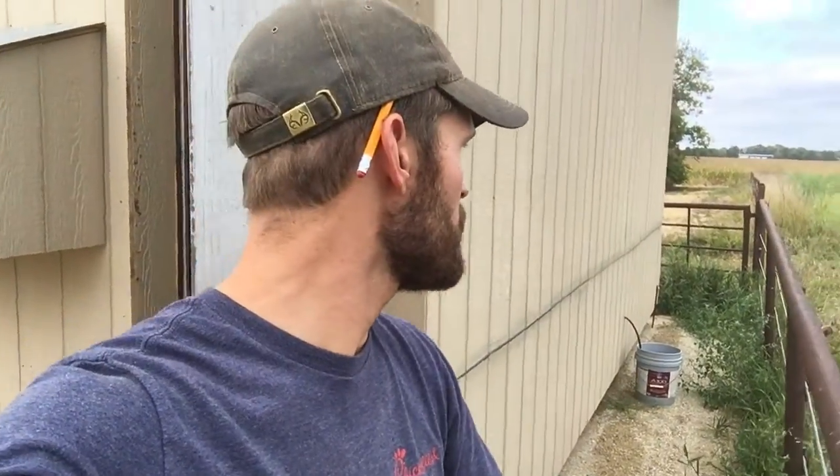This is the drain back here that comes out of the dehumidifier, and basically it's a visual aid to help us figure out how much moisture we're pulling out. Just because the dehumidifier is running doesn't necessarily mean we're pulling out moisture, and that's kind of a thing to watch, especially with walnut. When it stalls out, the compressor may be running, but it may not be pulling out water per se. When we first put this walnut in, we were pulling out about a 5-gallon bucket per day. So it can pull out a lot of water.